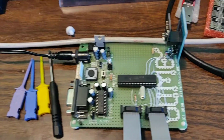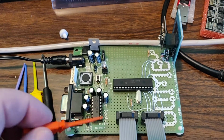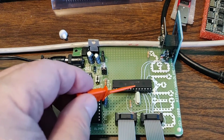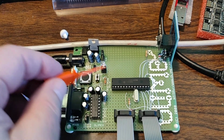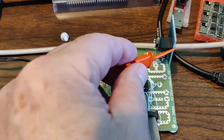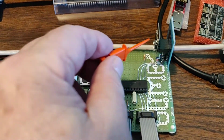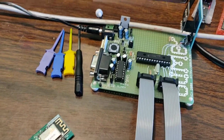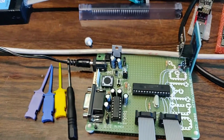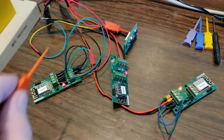But basically I'm using a development board, and don't have to worry about this stuff here. It's all serial. Basically just a standard PIC processor, crystal, and some power circuitry. And of course an adapter board because we're running 3.3 volts onto the Wi-Fi switches. And yeah, I got a bunch of switches back there. So this is version 1. We're using 1 wireless piece, this guy right here, to access all 4 of these.